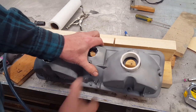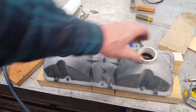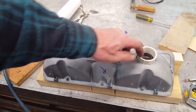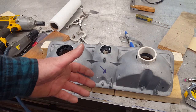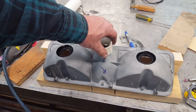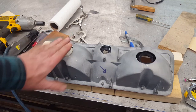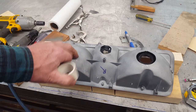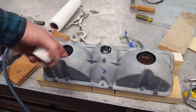And then, get this thing back up on here. The drill jig coming in handy here. Then I'll be able to seal around the outside here and cut the excess off, and then it'll be sealed. This entire thing will be sealed because that has a rubber gasket that goes in there with the bulb. So I got lucky. This one's going to be a little bit more of a challenge because it's tighter quarters, but hey, 4 out of 6, that's not bad. So same thing over here. Both of these fit over just nicely. So it's better just to make the housing a little bit more waterproof than to worry about how the water's going to get in here and cause some problems with the electrical.